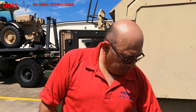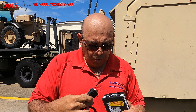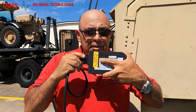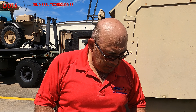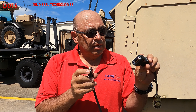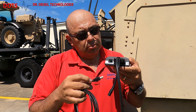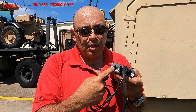Let's start with your V9 — connect your JDC 100, make sure you orient the connectors, and make sure you run down your thumb screws. While I'm doing this, you see this yellow tag right here? This is essentially telling you to make sure you do these connections before you even attempt to connect to the diagnostic connector. Now we're going to connect your JDC 100 to your JDC 548.9 — simple connection there. And finally your USB cable to your J-Link V9. This has a notch on it, so you want to make sure you orient the notch at the 12 o'clock position on the V9.